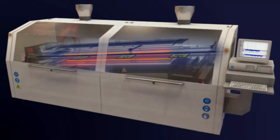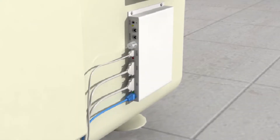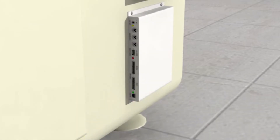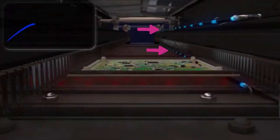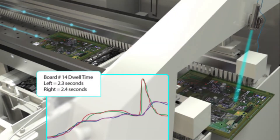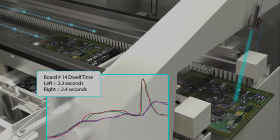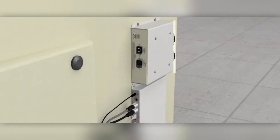The WPI system will calculate a virtual profile for every production board in the wave solder process. The WPI hardware consists of seven major components: the ETPU control unit, the conveyor speed sensor, the KIC probes, the solder pot thermocouple, the pyrometer, the interface to the controller PC, and the alarm relay and light tower.